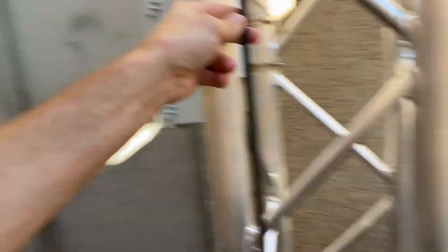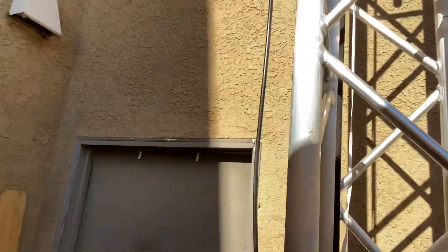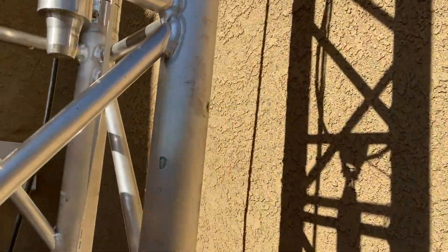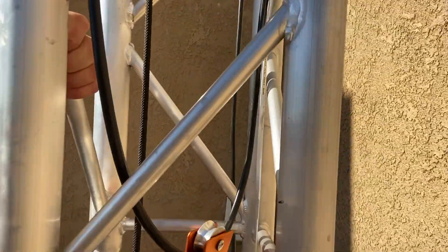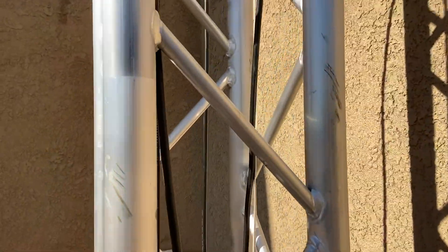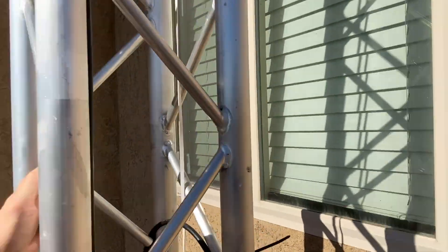First I'm going to climb up and show you a couple things. Here's my outdoor enclosure and my pulley system — I used two pulleys. What I have right here is a light counterweight system. This is a pulley on the actual LMR cable. It's a really stiff cable and it doesn't really tuck down — it's just enough to make sure the cable doesn't get caught when it's raised and lowered between all these little struts.